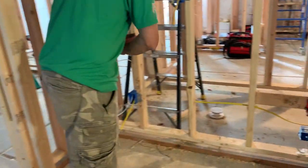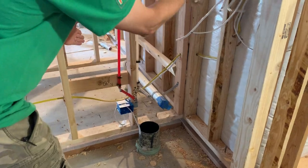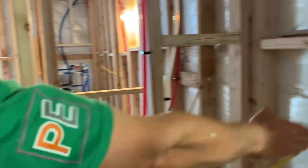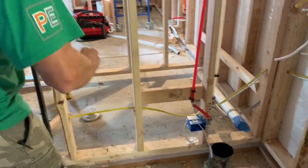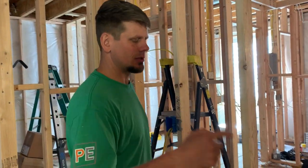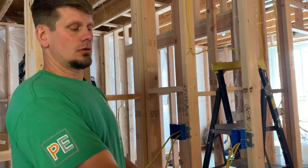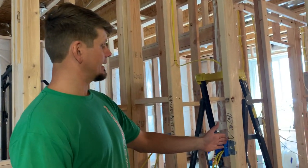So what they're going to do — this is all going to be open except for a cabinet and garbage disposal here. We have a switch up here; we could have done a pressure switch. This is a dedicated circuit. Circuit two and two. There is a sink — an oversized sink with a cutting area. Code talks about measuring to the inside edge of a sink; the whole unit drops in at 39 inches, so there's about 18 inches right there — that's technically sink number two. I put the outlet right up to that edge.